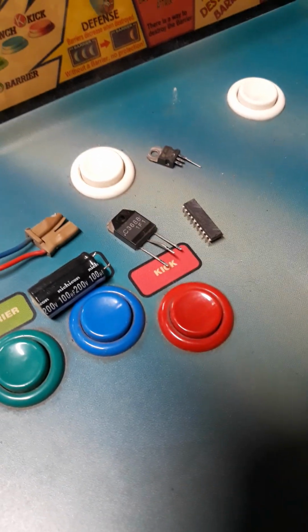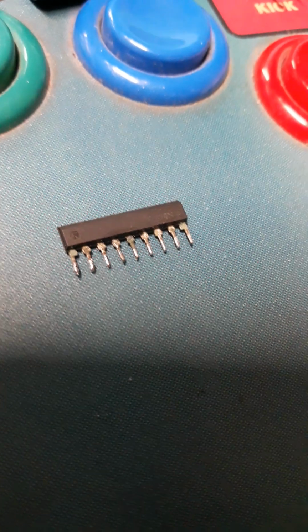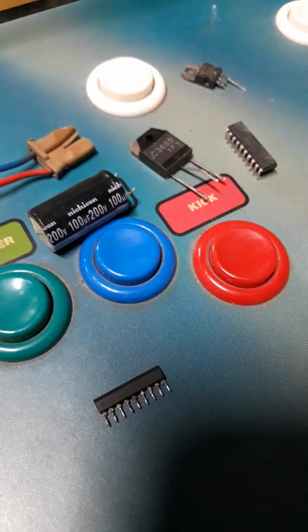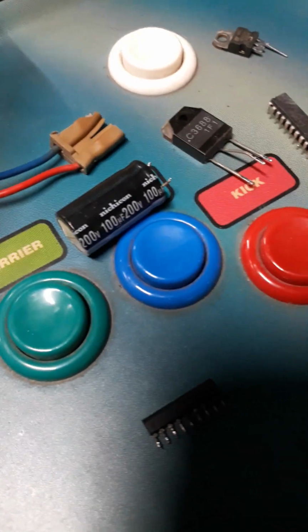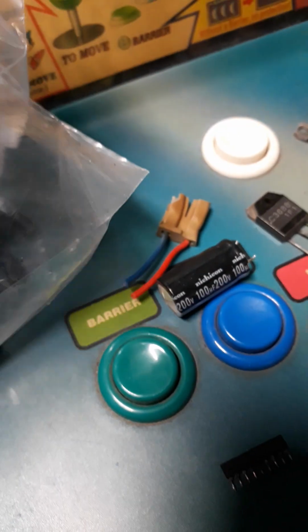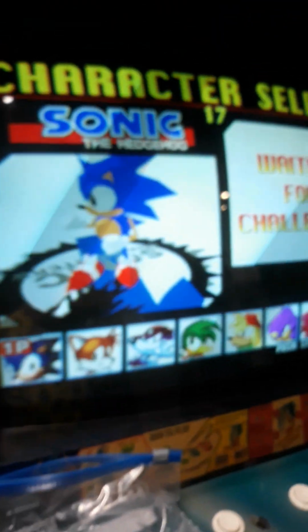Oh, all the time. I've never seen this one before. That is from the audio board. It's an op amp, Japanese style, SIP, single inline pin chip. And so much of this is basic maintenance, correct? Yes, basically things that you should be doing regardless. And the monitors, I basically changed every electrolytic that hasn't been changed already. It's time. Oh, you just can't get away from it. You need to change them all.